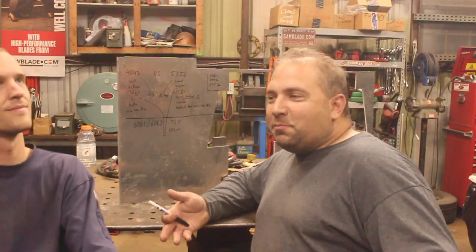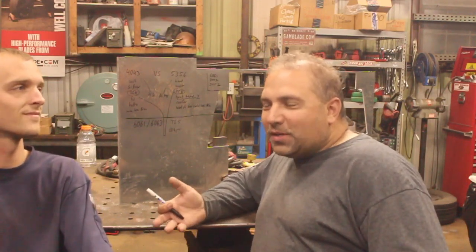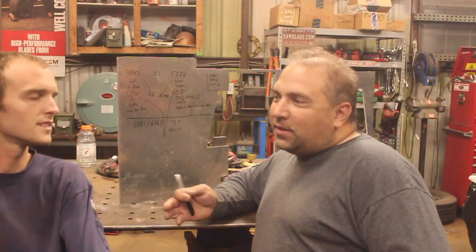If you follow procedure, Pete and I are probably both in the clear. I welded cast aluminum bumper brackets on semi trucks where a guy backed over a fire hydrant and cracked the cast aluminum bracket. The bracket was designed to fail first so it doesn't bend the whole frame — that's why it was cast aluminum. I welded it back together and it held up just fine for several hundred thousand miles until the guy sold the truck. It doesn't mean it's right, it doesn't mean it's wrong — it meant in that particular moment, it worked.